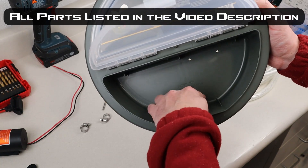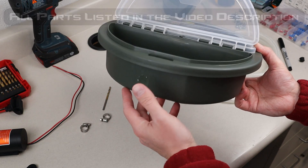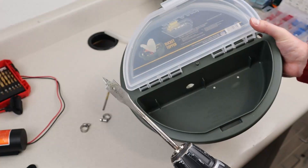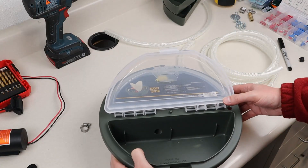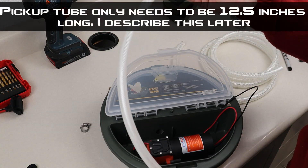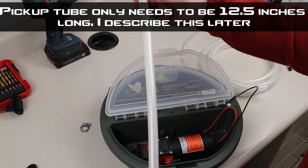You can see I have the three holes drilled. I also drilled here and elongated this hole so the tube could bend at a tighter angle. These were 5/32-inch drill bit holes, and I used a 5/8-inch spade bit to drill the hose holes — it came in at an angle and worked fine. Basically I just took 20 inches off a 10-foot section, so I have about 8 feet here and a little under 2 feet for the intake.